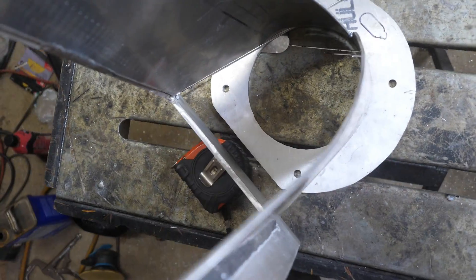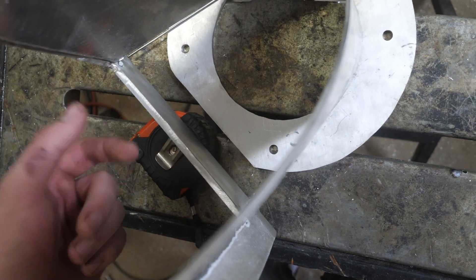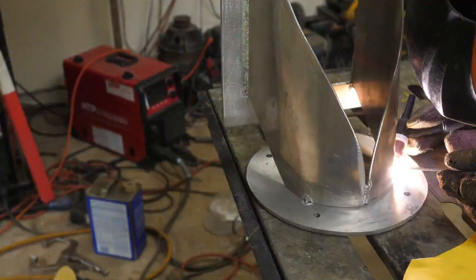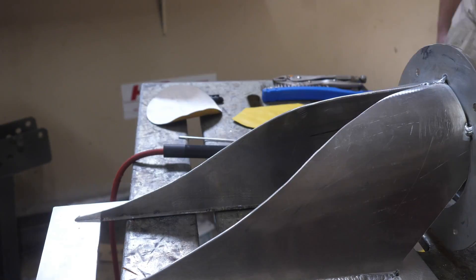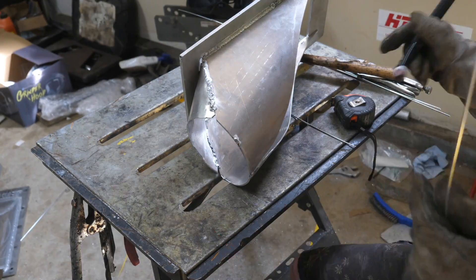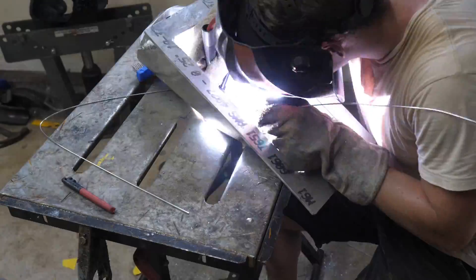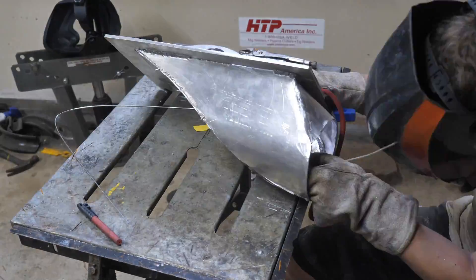It's actually coming out really nice. I need to go ahead and block this part off right here, so I'm going to get some paper and cut out a template. It'll probably take a few tries to get it right. This is the one part where you really do not want any leaks — a leak on this thing is basically equivalent to losing horsepower. I got that piece cut out and I'm welding from the inside and outside to maximize strength, doing the inside first and then the outside for the more aesthetic welds.